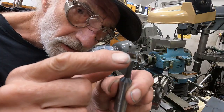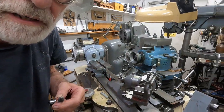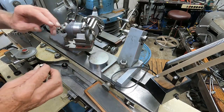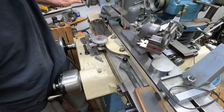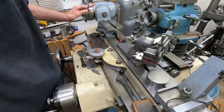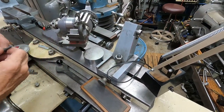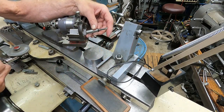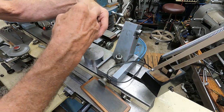I can control the angle here readily on the cutter grinder. Let's see if I can get this to focus down here. This is the workhead — this is the All-Tool Rotodex — and I could just as easily use the regular standard workhead. It's a lot heavier, but the smaller one is real fast and real nice to use. The standard head is very nice to have and it'll do this too. I've got this all leveled out here and I'll put the tool in.